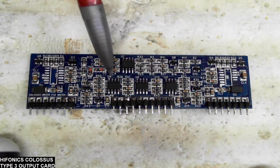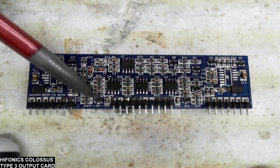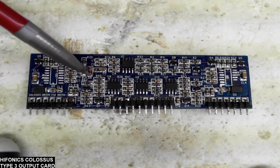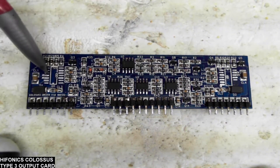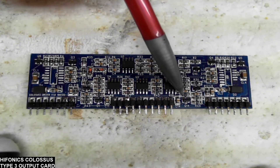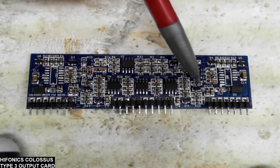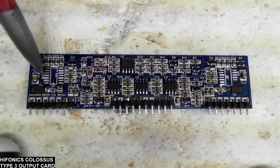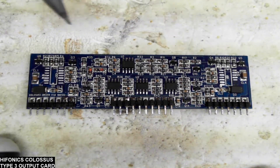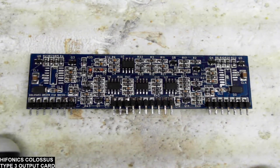So I think this is where they're coming up with that 'dual' statement. This 211 here is going to give you your plus/minus 5 volt square wave on Q1, Q2 for this bank — for this 21844 — and then this 211 here is going to give you your plus/minus 5 volt square wave on Q14 or Q18. So you have a square wave for this side going to pin 1, and then a square wave from this side going to pin 1. This is your protection — I see here at the top — this is going to be a 293, which pays attention to your over-current shunt resistors on both sides of the board, bank A and bank B.